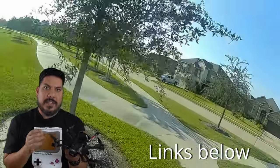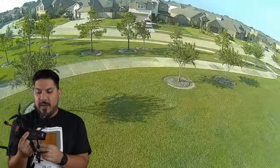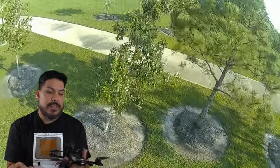And if you're using the DJI radio, you get that easy 14 wire buildup. Oh, so great. You can also easily just use Crossfire or any other receiver system that you want. It'll just be an extra 3 or 4 wires to set that up, which is really not a big deal. If you can see my flight controller in some of those shots, there are no wires above it because I had no soldering on that flight controller at all. My goodness, how easy and pleasurable it was.